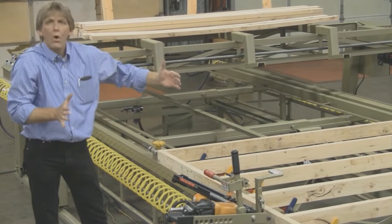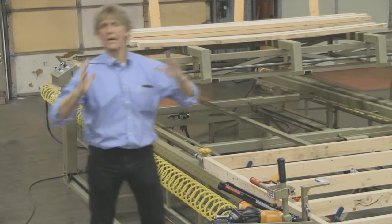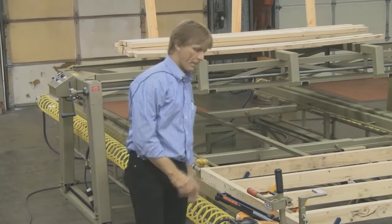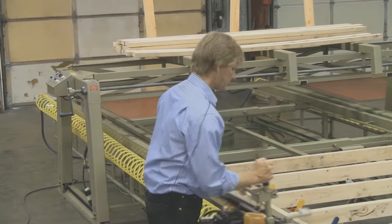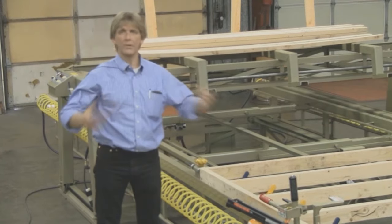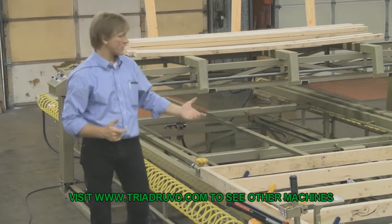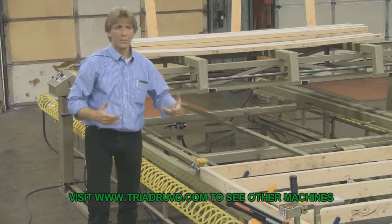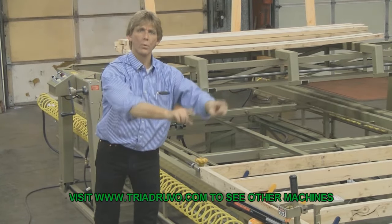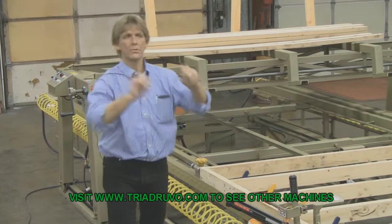The table comes in and squeezes the wall and clamps it, basically holding it in place — it's not a vise, so it doesn't squeeze for inconsistency on the scoring lip if your wood is warped. We also make a Gen 2 tabletop configuration where you can actually walk through. The advantage of the walk-through is you can take your window bucks and door bucks, lay all your studs, and actually roll it into the wall with one guy. Also, when you're done, you can push the entire wall off.